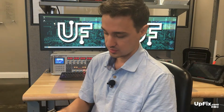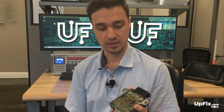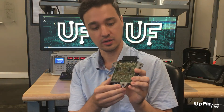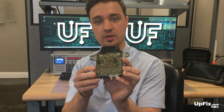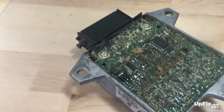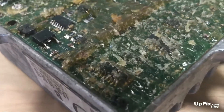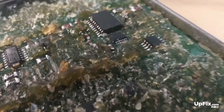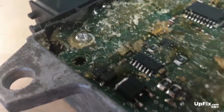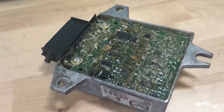These are from different vehicles. This one right here, as you can see, is one where somebody had already tried to strip or remove all the silicone. If you look closely, the silicone is all removed. We don't recommend doing this because if you're trying to remove it with tweezers, you can accidentally take off any one of these tiny components and damage other parts on the circuit board. Also, the silicone itself protects from moisture, oil, any kind of liquids, water, etc.